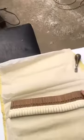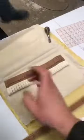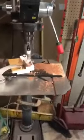So for those of you who just joined us, we are preparing a set of grand piano hammers to be installed into a piano. The first station here is sanding the hammer felt to make sure they're all even and shaped correctly. Then we take it to this station where we bore them, meaning we make the holes for the hammer shanks to go into the tails. Then they come over to this station, which is where the hammers are coved.